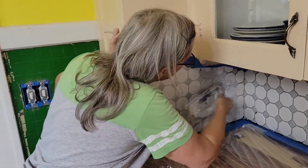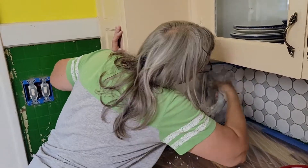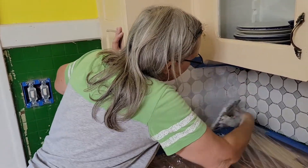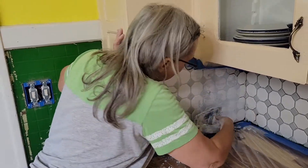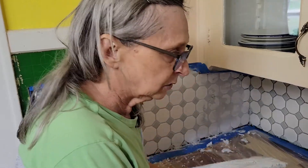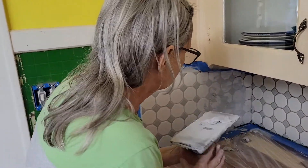I scrape it up here and just work it into the various grooves as you can see. Bruce helps me by keeping me supplied with clean water, which is quite a job to haul those heavy buckets. If you don't have clean water, you're going to have a mess with your grout because you've got to get all the residue off or it'll get nasty.